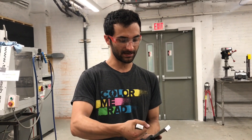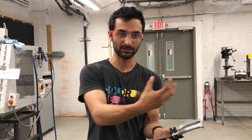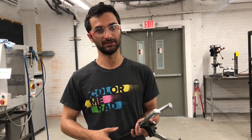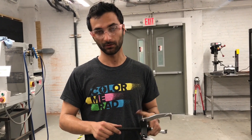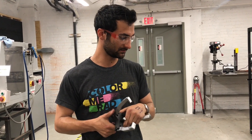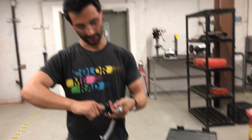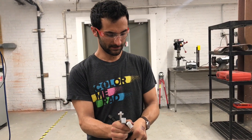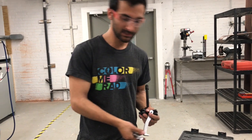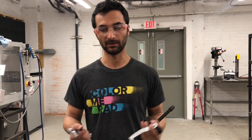These teeth sit on the back side of the bearing, and then you turn this with a wrench on the back side and it just slowly pulls it off. The alternative is finding yourself with a hammer, whacking it around the edges and applying force unevenly so it kind of wiggles off — so this is the right tool for that job. Occasionally this is just a day saver. This is just a smaller version of this same setup; these just pop off like this. Pretty simple tool to use, and it can work in conjunction with the arbor press, which is why I mentioned it here.